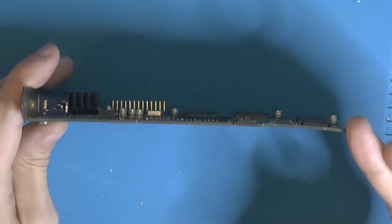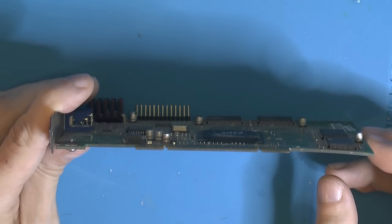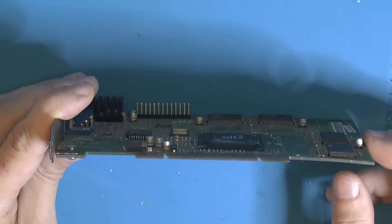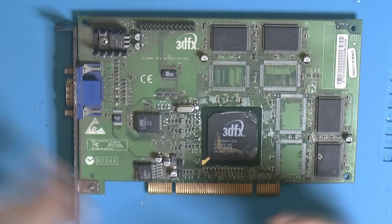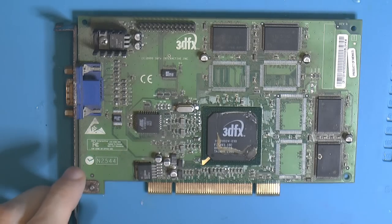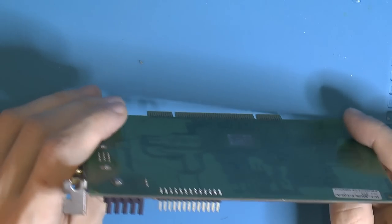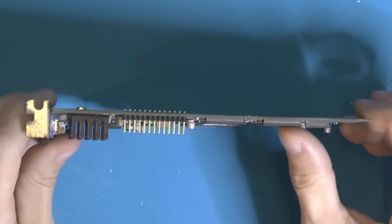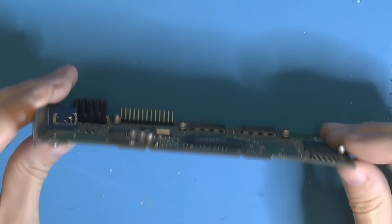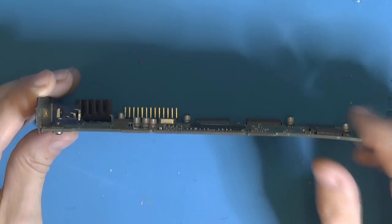And eventually I found someone that seems to write in a manner that he was sure what he was saying. So he seems to recommend about 130°C. A lot of people were like, you need to have it hot enough to melt the solder and it's gonna break down the epoxy. And yeah, that's true, we break down the epoxy. That's actually why you get this coloring, I guess, from too high of a heat load. So he recommends 130°C, and you obviously need some kind of fixture to bend it back so you can actually get it into the new shape, which should be flat.